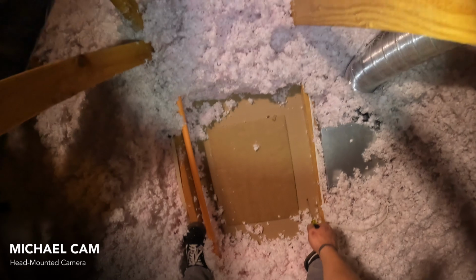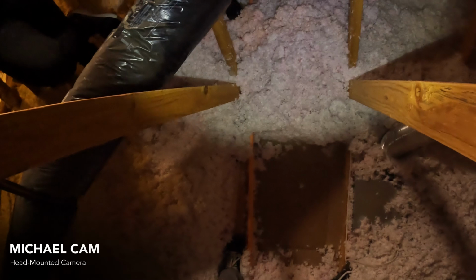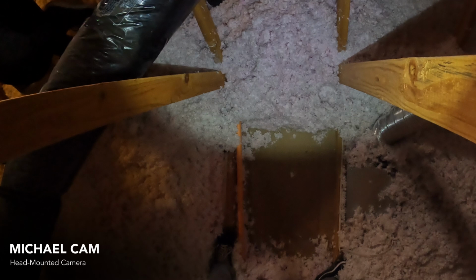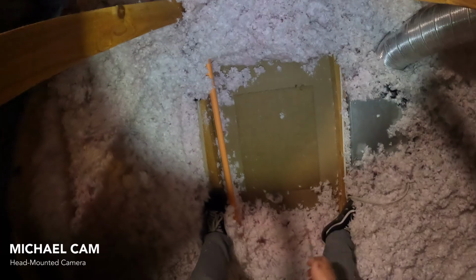Yep. If we do happen to go against the truss, our plaster grounds are removable. A little pry with a flathead, they pop off and allows you to go flush against that truss. And there's a way you can fasten it to it. Yep, absolutely. Okay, so we could make a pilot hole and then we're ready to rock on this too? Absolutely.